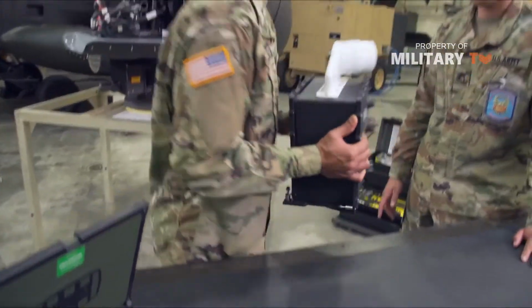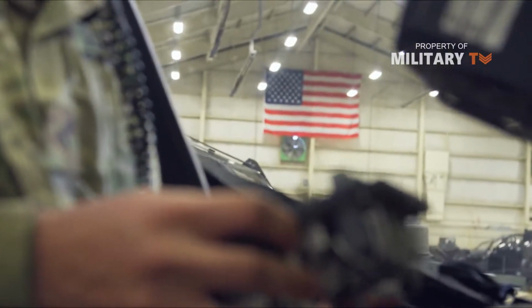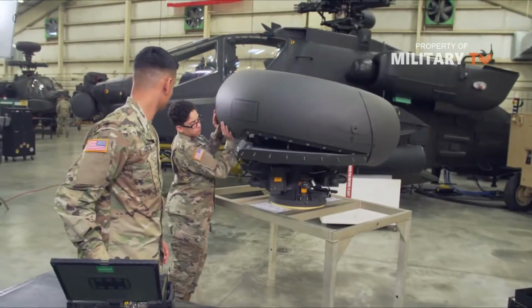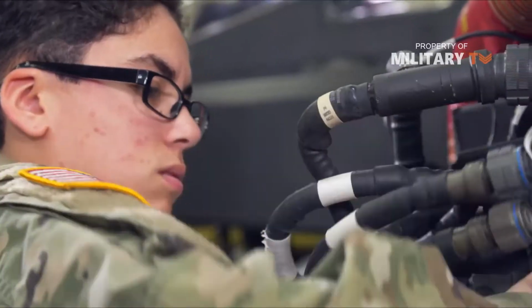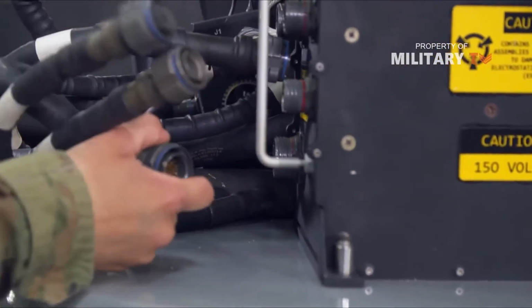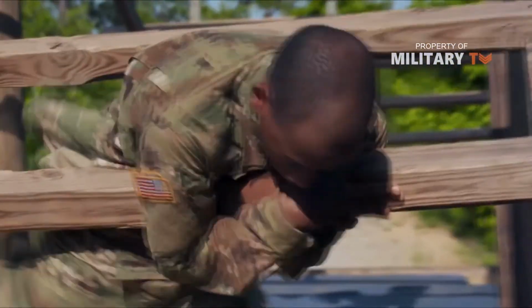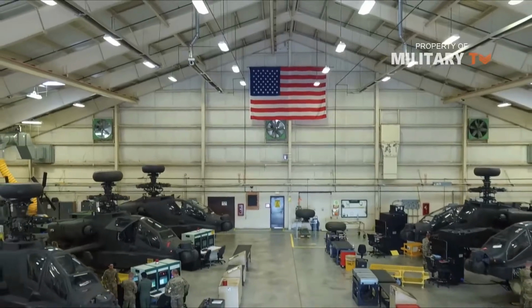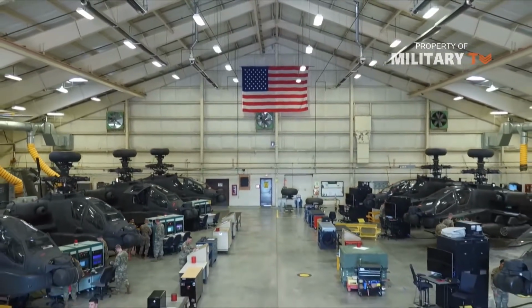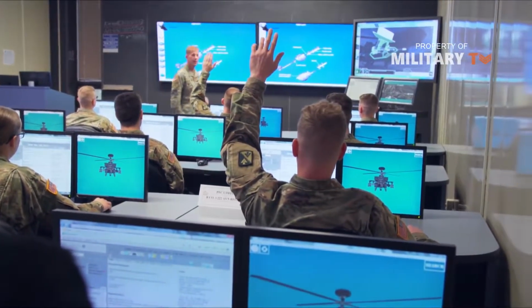The computer transmits the night vision or video picture to a small display unit in each pilot's helmet. The video display projects the image onto a monocular lens in front of the pilot's right eye. Infrared sensors in the cockpit track how the pilot positions the helmet and relay this information to the turret control system. Each pilot can aim the sensors simply by moving his or her head. Manual controls are also available, of course.